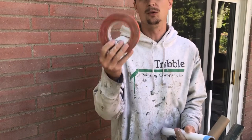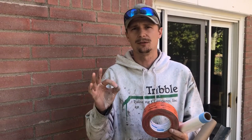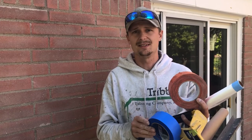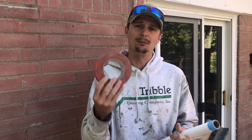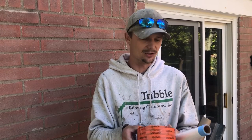Next up, we've got Orange Dolphin Rough Tape. This tape is perfect for exteriors, sticking to brick. Your normal blue tape — normal painter's blue tape — that's not going to stick to the brick. You've got green tape, that's not going to stick very well either, a little bit more adhesion there. But this is the stuff you want to use for any kind of rough surfaces. It's going to give you really good adhesion.